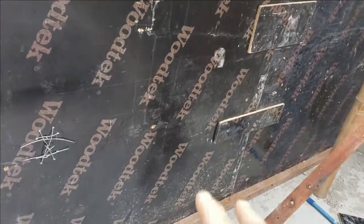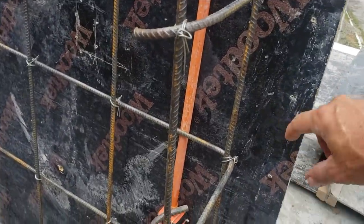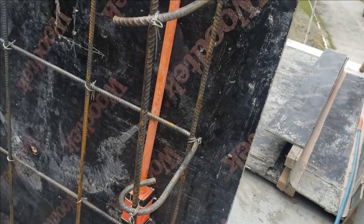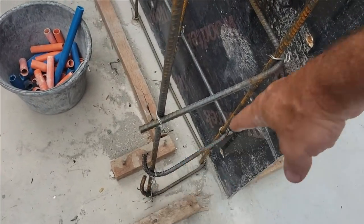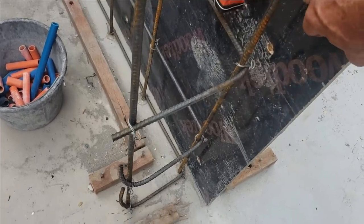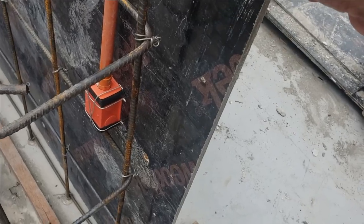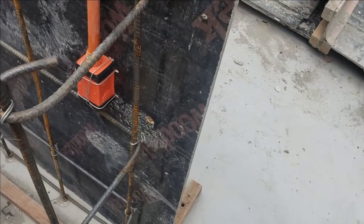Yeah, every piece doesn't have to be cut. So what you can do is, if it runs out past where you need, like this here, it ended up going out past where needed, but I don't know, got lucky on this one, on about 2.5 inches. Well, your other sheet, you see this little slot down here, that's where the wall's going up here and butting. Just butt it right up, and actually it's going to work out perfect. And you can just put a 2x2 up this corner and screw it, and that'll help you get your cribbing on as well. But let's just say if it was an extra foot, still just put your 2x2 and leave that extra foot hanging out there.